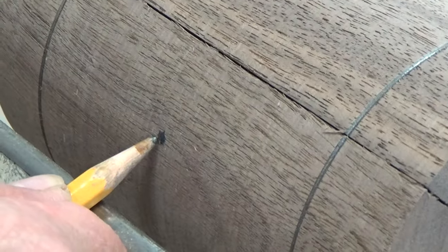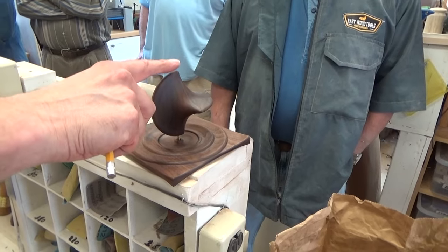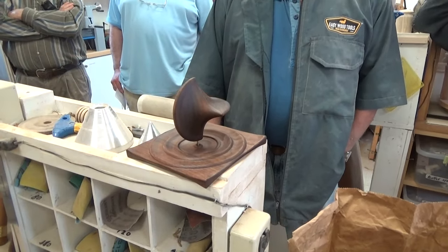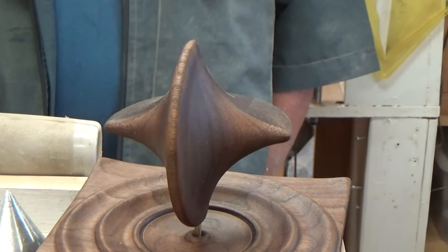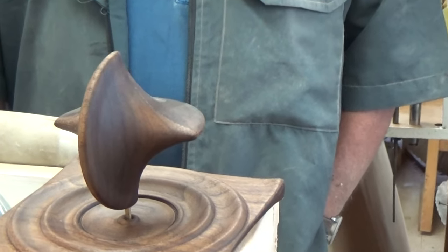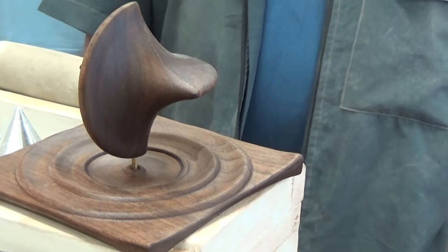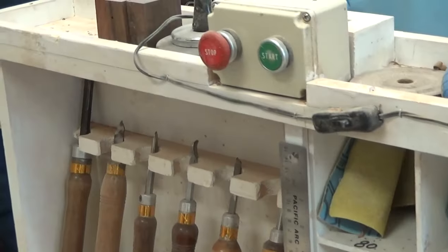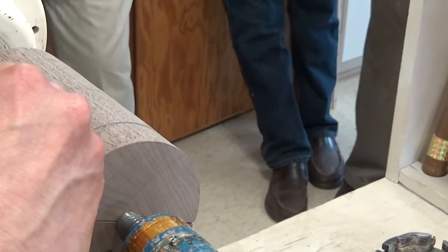There is my center, and I am going to mark that. We've got to make two more pencil marks here. Your eye will complete the shape out to an edge, and that edge will have a width — we're going to mark that width now. This is an important point I'll emphasize again at the end. A very small edge is elegant, but it's also risky, because this width will end up being the spindle width at the end. The thinner you get the spindle width, the more likely the whole thing will shear off. So I'm going to make this one a full 3/16ths on each side.